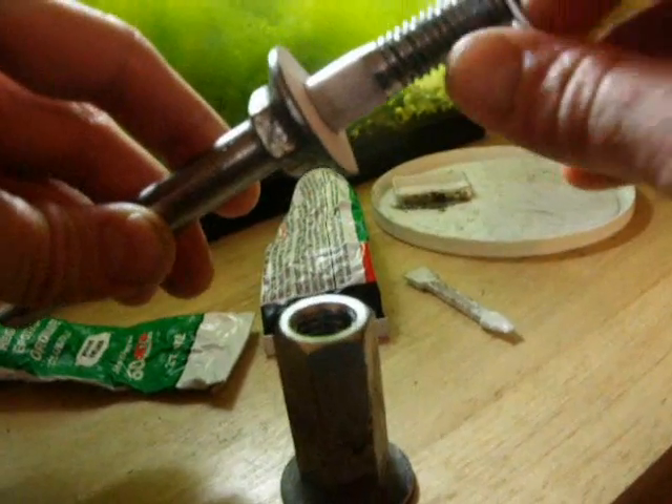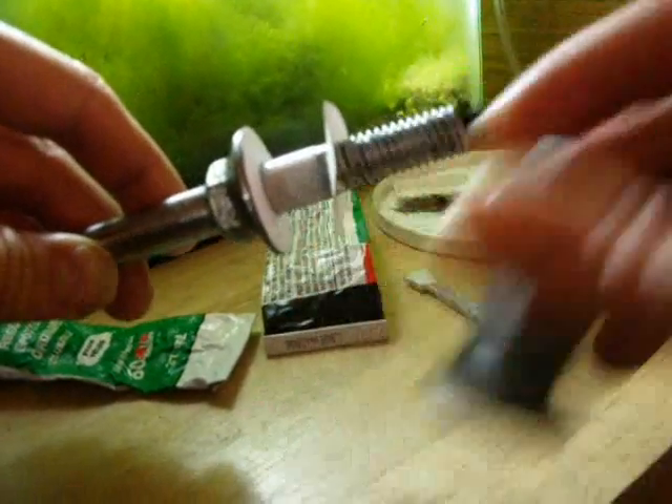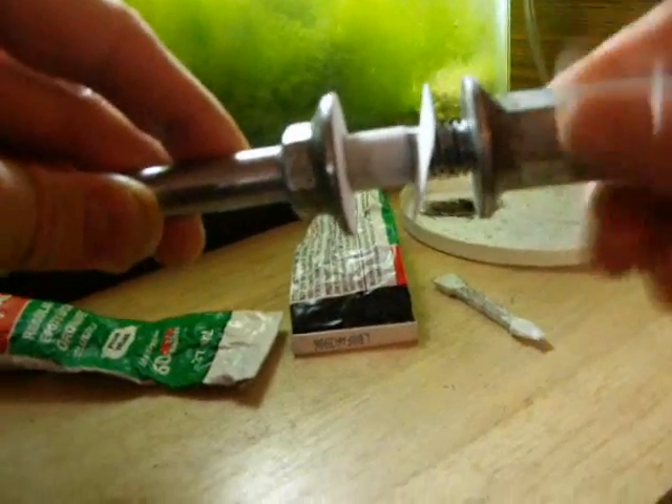Step number two. I'm putting two paper rings which will protect the coil. These insulation rings will protect the coil wire from any other elements — it will work like an insulator later on. So here I'm putting them, and I'm finishing assembling the machine by screwing the nut onto position.